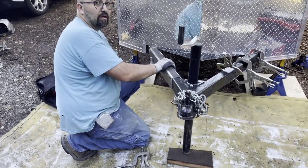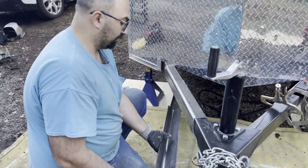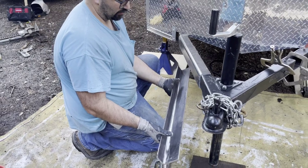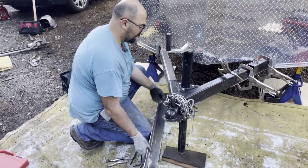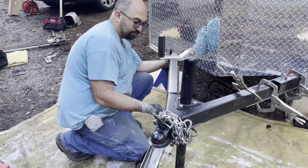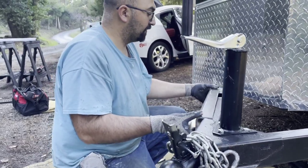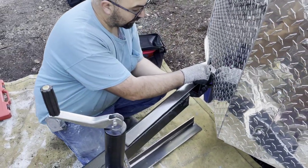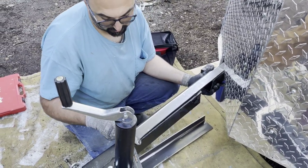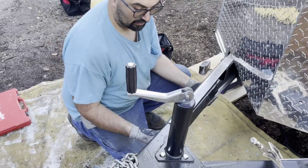What are you working through here? So I got the piece, I just had a random length of tube that I cut, which is angle technically. So I'm putting that piece in and it makes it go even further back. And then the piece that I measured was 24 inches. It's fitting perfectly here. I just have to notch out a little corner there so I can put my weld there, weld here, here, here, and then box it in.